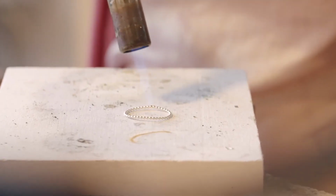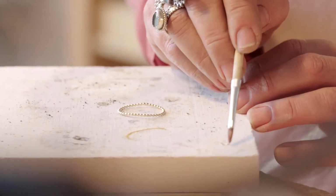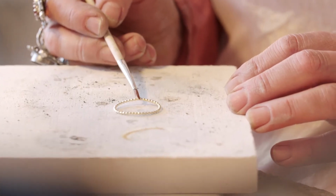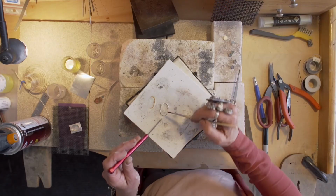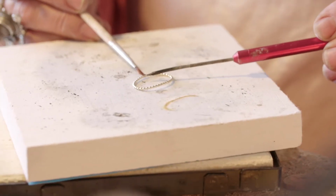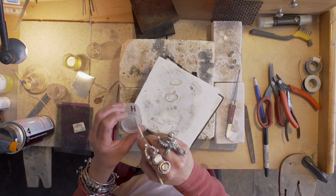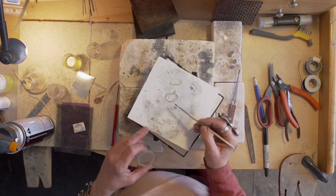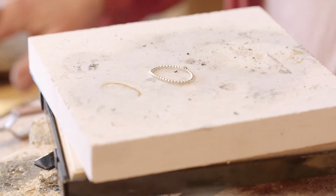Now I'm going to get this a little bit warmed up. The marker will start coming off, but now I'm going to get this right between my marker pieces, right here. Oops. A little bit stuck on here. Sometimes that happens, guys. I like when things like this happen because you can see things aren't perfect all the time, right? Anytime you're putting together bezel wire, you want to work with a hard solder. Anytime I'm away from my piece, hard solder. There we go. Perfectly placed.